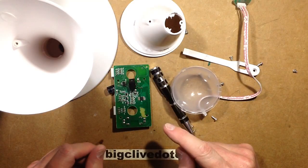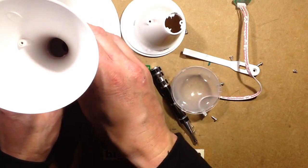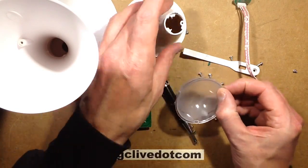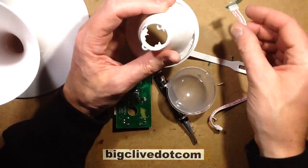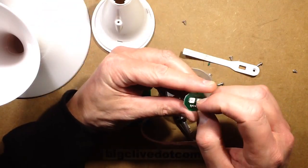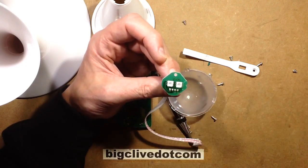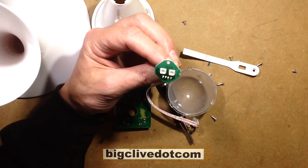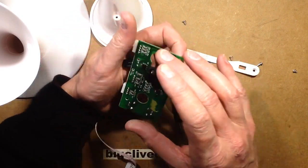I could not easily get those to unclip — they've obviously been put in with extreme force, and because there are four clips it's quite difficult to undo one without the others clicking back in. What I ended up doing was prising one of the little cups out the top, which revealed one screw holding it into the housing. Then if you lift that out, there's a circuit board in the back held on with a single screw. It's got two 5050 LEDs — the standard six-pin 5050 with a red, green, blue chip in each — wired in series, which makes sense from the nine-volt aspect: the combined forward voltage for the blues and greens will be about six volts and for the red about four volts. They've got different values of resistors to match the intensities and bring them close to each other.